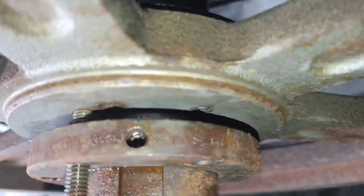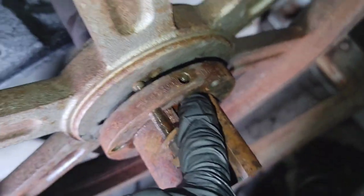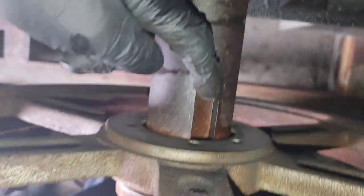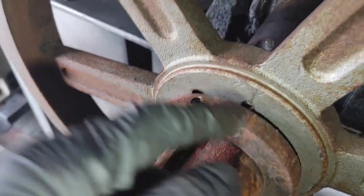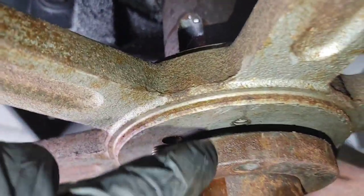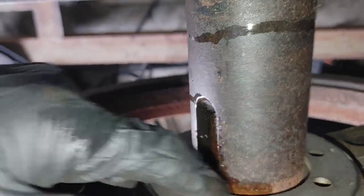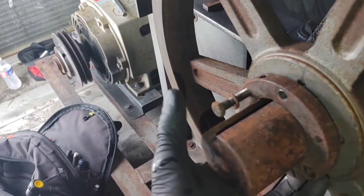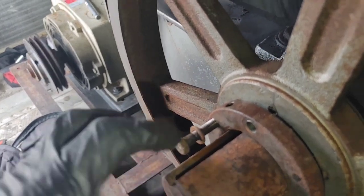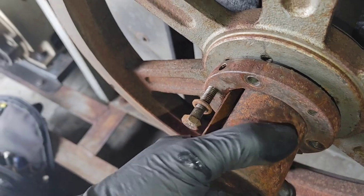You've got this Allen down in here. Loosen that, and then from the backside here, you've got to pop this out. This slides in there like that, and it slides back out, okay? Once that's done, you've got these bolts that sit in here, and they screw down into there, and they almost come through back over here. And it seems like this is like a wedge of some sort, to where the closer it gets sucked into this, the tighter it's going to make it against this hub.